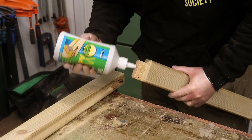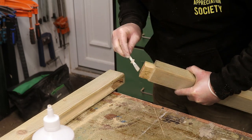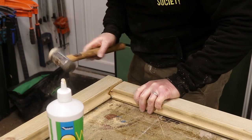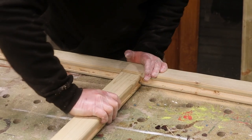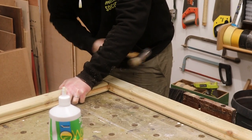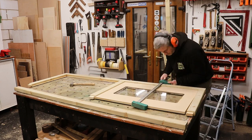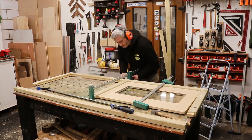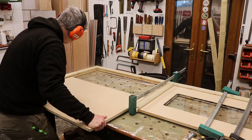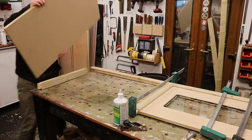It's fair to say I was a bit nervous about this glue-up. I'm using polyurethane glue here because I know it works really well in exterior conditions. I knew it was going to be tricky to get all of the pieces of the frame together and get the panels fitted inside the housing grooves all at the same time, and it was every bit as challenging as I expected — so there's a whole lot of panicking and awkward clamping going on here. I probably would have made life easier for myself if my housing grooves hadn't been so tight to the panels. You'll see that I even used a block plane just to add a small bevel to one edge of the MDF to help me get the panel fitted.